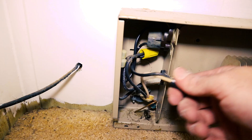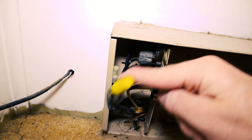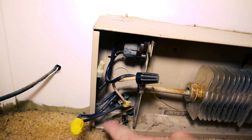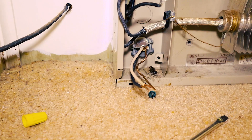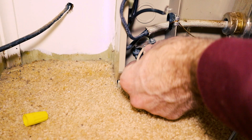I'll be using a different type of screw temporarily because I'm replacing this carpet, so I'm going to make tiny holes with tiny screws and come back later to permanently affix it with bigger wood screws. Now let's discuss the electrical. You have your neutral tied into a black, then you have your power tied into a black — it doesn't matter which one you connect to the heater. Two black wires from the heater, and a black and a white coming from your circuit. You also need a wire clamp — you can reuse the one from the old unit.